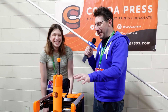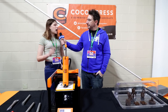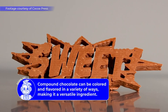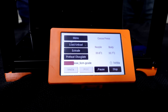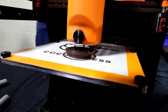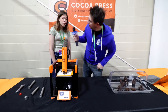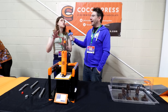I didn't think that some of this stuff would be possible with chocolate. You've tried all sorts of chocolates in this thing. So what has caused the chocolate to perform the way you want it to? We actually moved to a compound chocolate, which means the fat base is a palm oil, and it still has cocoa solids in it as well. That basically allows the chocolate to solidify at a higher temperature. So we're heating it to the lowest possible temperature it will flow — it's more of a gel than actually a liquid — pushing on it with about 10 pounds of force, and then it solidifies in the ambient temperature. There's no part cooling fan or anything. We have one fan in the back for the electronics, and that's it. So this thing is so quiet.